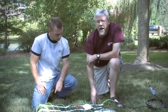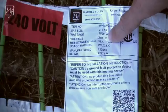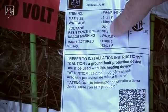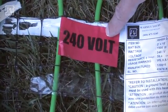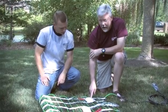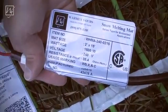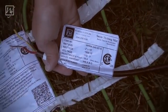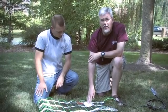We've flipped the mat over the rollover and there are a couple of things to bring up. First, you want to make sure it's the correct voltage — there will be a voltage sticker on the mat itself telling you whether it's 240 or 120. Also on the mat there are labels telling you what the ohms values are, what the cable lengths are, that sort of stuff. That information you do not want to bury in the concrete — take those labels off and give them to the homeowner so they can complete their warranty card and turn that in.